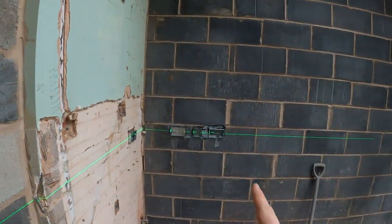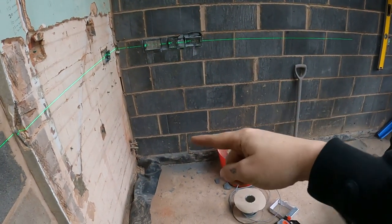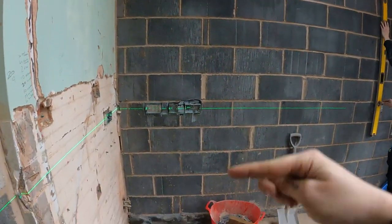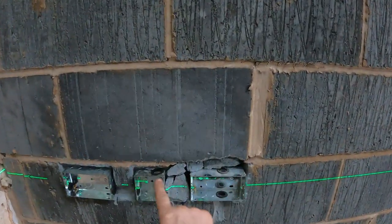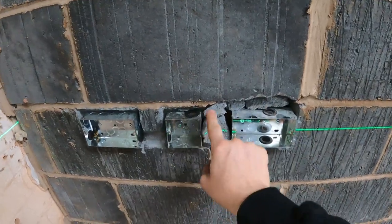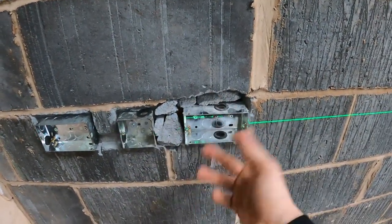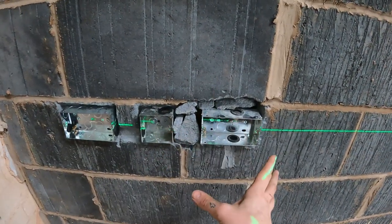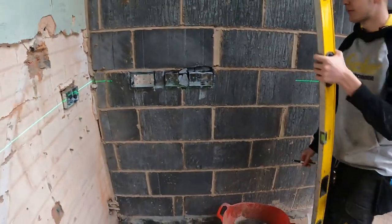We've got all the boxes in now. We decided to go for the 47mm patress boxes in the wall to cover our zonings coming down, because if you get someone like a kitchen fitter and the lower-level cabs are already in, they would have no idea there's going to be a big cable going in here. It's an extra single socket, but because of the depth of it, it's blown the back of the brick out. So this looks like a dog's dinner, but we've wooden-framed it all back so it's nice and solid to the wall, equal distance between them. For the plasterer's sake, I've just put a bit of brick back in so we can put some plaster on there - it's got something to hold to. We'll chuck some CT1 or silicone just to hold this in place. This is all going to be dabbed over and boarded anyway, and the board should be cut clean with this, so none of this will be seen. But this is real world, this is what happens, and we made the best of a bad situation.